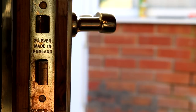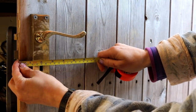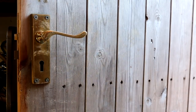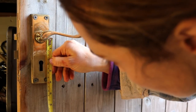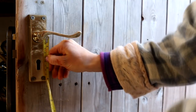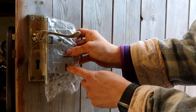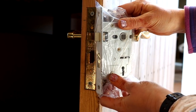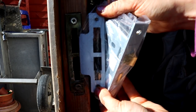I knew nothing about how to replace this, but after watching a YouTube video I found that I needed to measure the backset, which is the edge of the door to the centre of the keyhole — mine was 45 millimetres, which apparently means you need 65 millimetres. I also measured the centre of the handle to the keyhole, which was roughly 60 to 70 millimetres, and I found a 64 millimetre one from Toolstation for £5.98. I held it against my existing one to see if everything lined up, and it did, apart from the sash lock being slightly lower, but I did get a new keep to fix to the door frame.